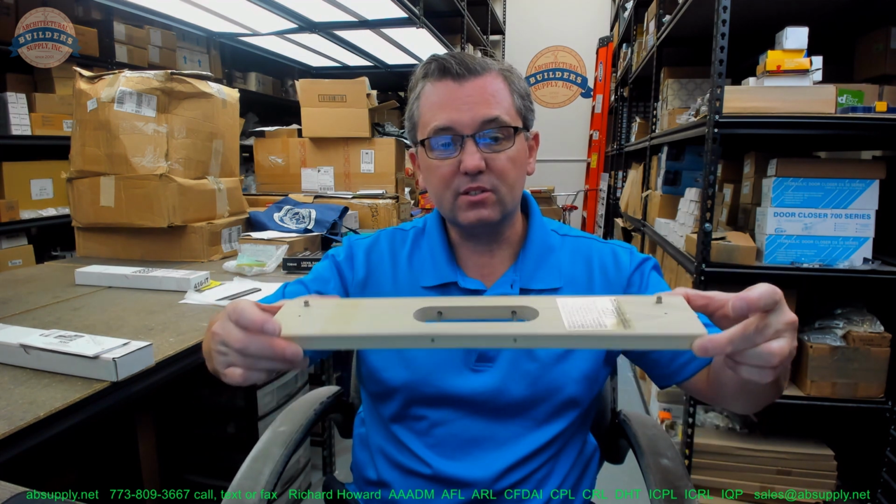If this rocks on your door edge at all, you're going to need to inspect the edge of that door to make sure that it's flat, that it's been planed. I've gone to prep doors in the past and I've realized my template doesn't sit right, and then I realize, oh, I've not pre-fit the door yet. So pre-fitting the door is step one.